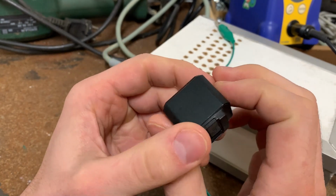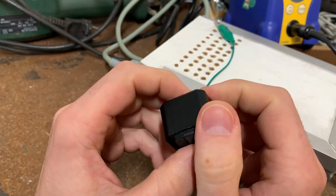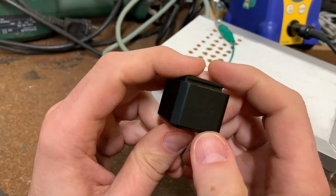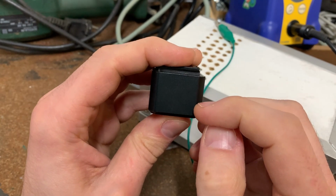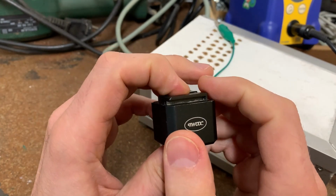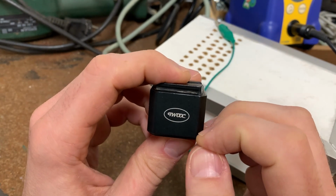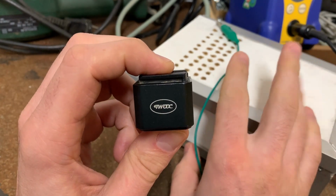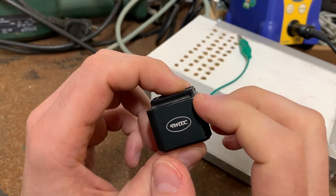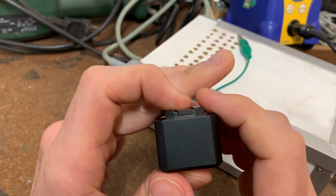That's the same thing that happened to the EV up here, that can't be disabled or switched off completely, which discharges itself over time. And I think the same thing happened here. The battery just got so discharged that the electronics of the BMS does not recognize the battery and does not start the charging. So we have to manually charge it a little bit, give it a little push start, and then the electronics will recognize it again and will charge the battery up again. At least that is what I think.